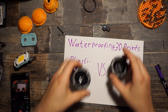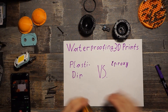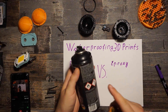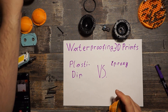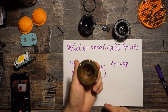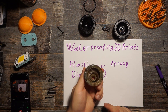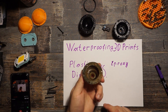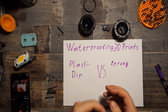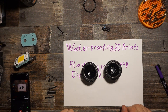First I have to say something about liquid rubber and ABS. If you use PlastiDip from a spray can, there is acetone inside as a solvent for the liquid rubber, and acetone and ABS is not a good fit. So liquid rubber out of a spray can will not work on ABS parts — I can basically throw this stuff away. So I reprinted them with PLA.